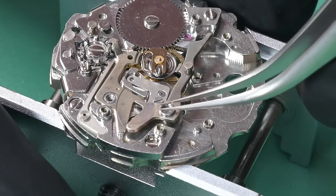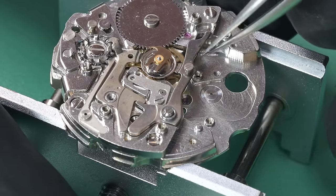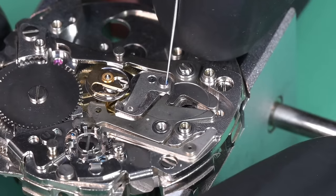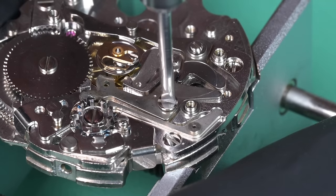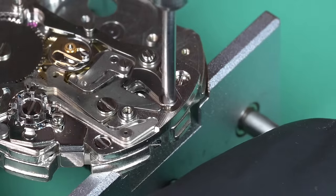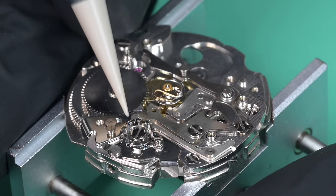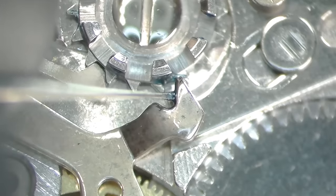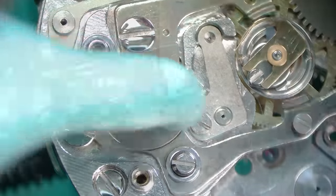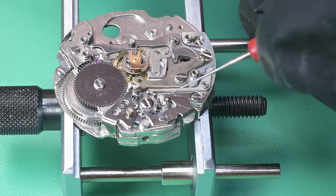In the UFO video from a couple videos ago, we built a Seiko 6138 UFO Yachtsman, and we went through all the eccentric pins on that watch — it's a dual-register chronograph with two more eccentric posts for the hour recording mechanism. Generally, if you never mess with those eccentric posts, you don't have to; when set from the factory they're good. But if someone goes in and starts turning them thinking they're screws, it can throw your hammer or chronograph mechanism out of whack. On this watch, everything was just perfect — it doesn't look like they've ever been touched.